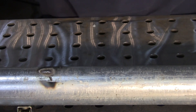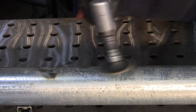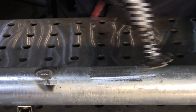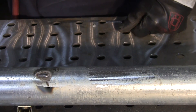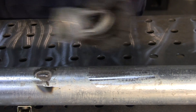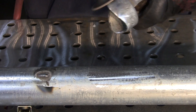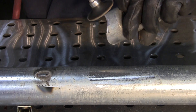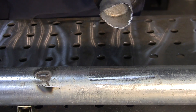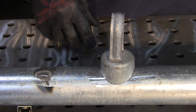The best way to get rid of that problem is to take your little grinder and get rid of that problem. So you're back on your bare metal, because when you're welding anyway, you're burning away that zinc oxide coating from the galvanizing. Then you take your other little piece and get that cleaned off. Remember, you got to have good ventilation no matter what you're welding, but especially galvanized.